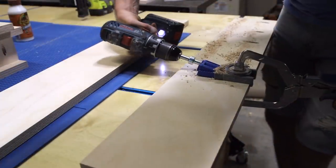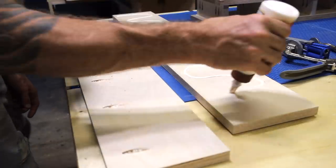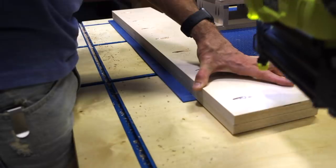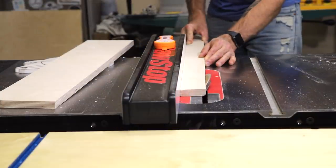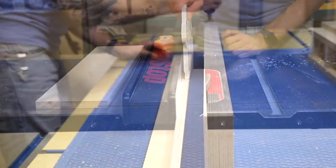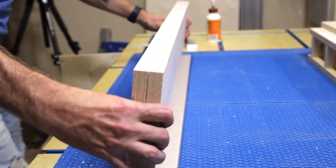For the fence on top of the stationary cabinet, I'm using two six-inch wide panels together, but I added pocket holes before this glue up so I could attach the vertical piece that makes up the front fence. I added a 45 degree chamfer so the sawdust won't interfere with cuts when I'm using the miter saw.